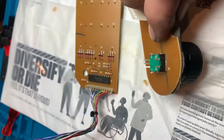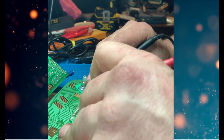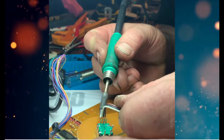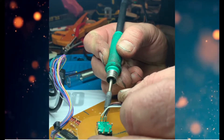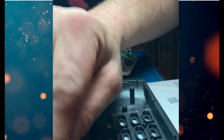The knob was just a tiny bit smaller than the hole and you could just see the circuit board, so I decided to put a bit of felt just to black it out. Once the encoder is mounted, it's time to identify the pads - identifying left and right and the earth for those left and right pads. There are optional connection points other people have used, but I just went for the front ones, soldering the three wires to the encoder. The middle one is earth, and left and right are the two outer ones.